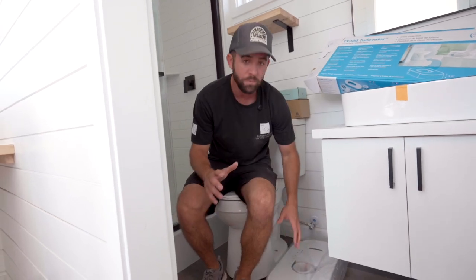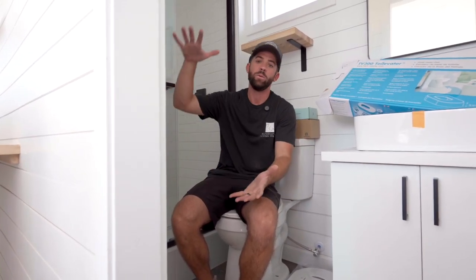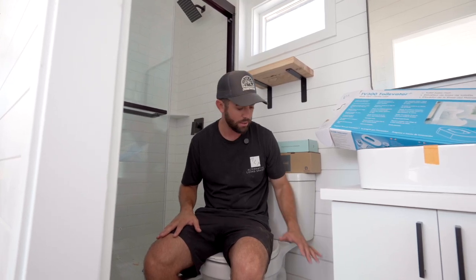Without this system, typically that drain line would end up being past the bottom of the container. When we go to stack these units, that would hit the top of the container, it would crack, it'd be a mess. So by having something like this, it's gonna raise your toilet 3 inches, get your drain line an extra 3 inches up towards the bottom of the container and give you clearance. Now, you aren't gonna have any issue with vanity related items. Those are smaller drain lines. The P-traps are up in the cabinet, so no issues there. But there is some things to show you on the shower.